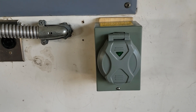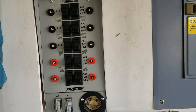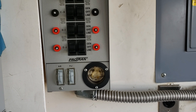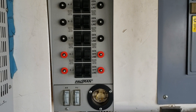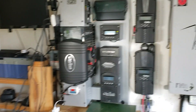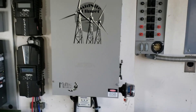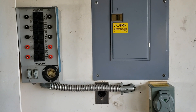With the inlet box you have power to the entire home — you can run your AC, heater, everything — but you have to get up and set it up. Which one do I prefer? As you can see I have both. I actually have a system I've been running for 14 years — it powers all ten circuits all the time, and it charges on solar and wind. That's my system — the batteries are down here, capacitors, inverter, solar controller, wind controller — the Clipper controls the wind turbine. That powers my transfer switch 24/7.